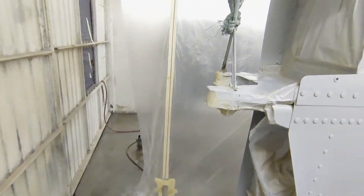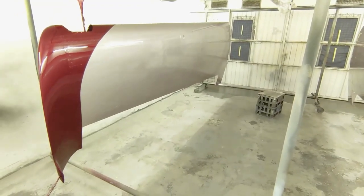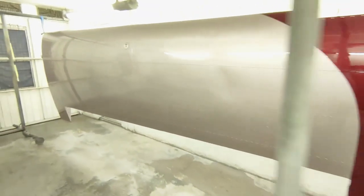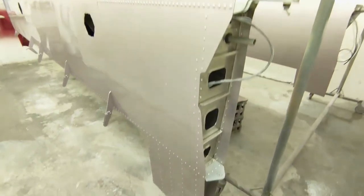Getting high build primer, sanding it down and building it back up again. The base aluminium wasn't that bad but still needed sanding to get the primer to stick. The final coat and clear coat was applied. There are still a few bits remaining - the vinyl accent lines are still to be added. The finish is quite good and it's come out much better than I expected. The main color is a silver, a little bit pink when the light is low, but in bright sunlight it should come out a nice silver.